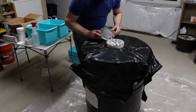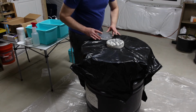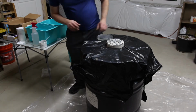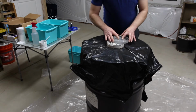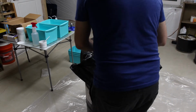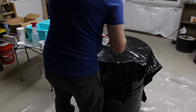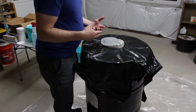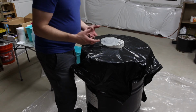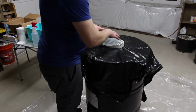To feel it again. We can kind of start to see that milky stuff, right? That's glass. It's glass dust. So we're gradually starting to grind a little bit. Awesome. You can probably hear the sound changing a little bit. It almost sounds like more grit is making contact, and that's probably because not only do we have a little glass dust in there, but the grit itself is gradually breaking down as I'm applying pressure and I'm grinding.